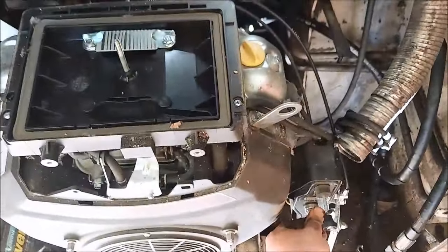So those two dots represent where the middle of those pipes are. So I need to cut them. Now I need to drill a hole that's an inch and an eighth. Well, I got a stepper bit, so I put some electrical tape on it to show me where. The problem is that is longer than this pipe.